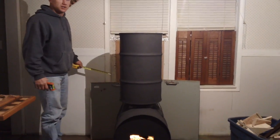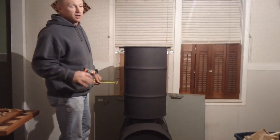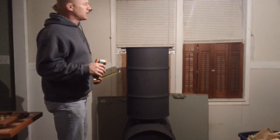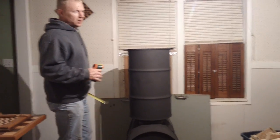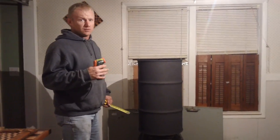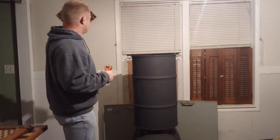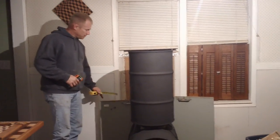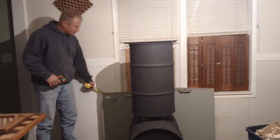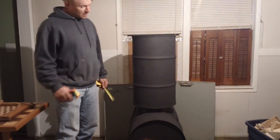The clearances on this are pretty tight. Here's the rule of thumb: if your house is 70 degrees, the wall close to this barrel can safely get up to about 115 degrees above your room temperature. So if you've got a 60-degree room temperature, add 115 and you get 175 — so this wood here could be up to 175 degrees and still be considered safe. I was approaching that on the backside of this drum.